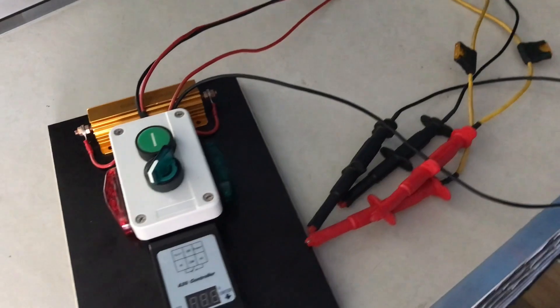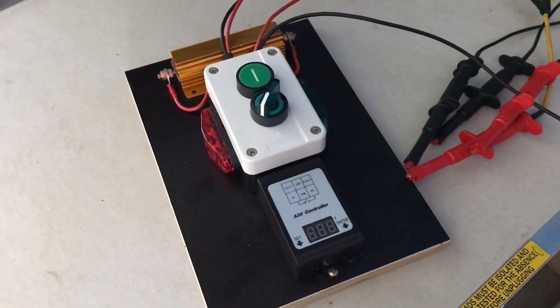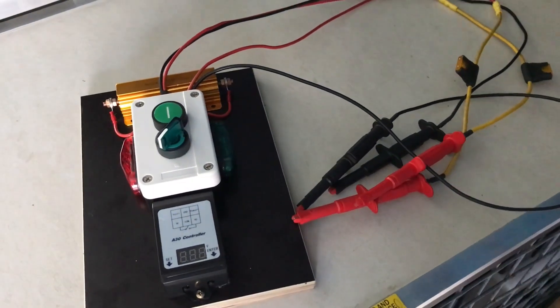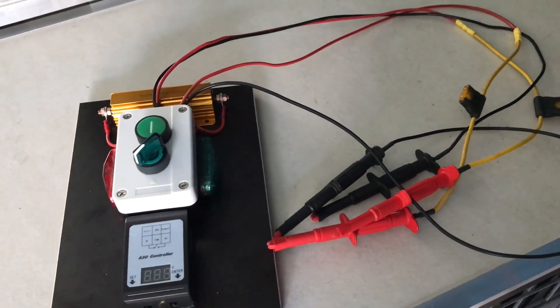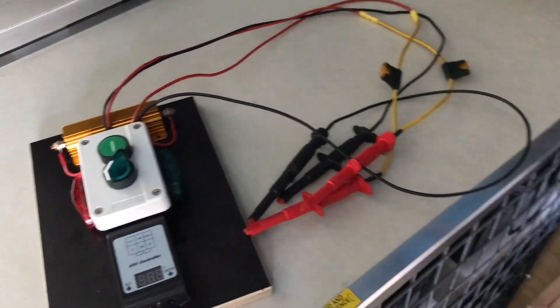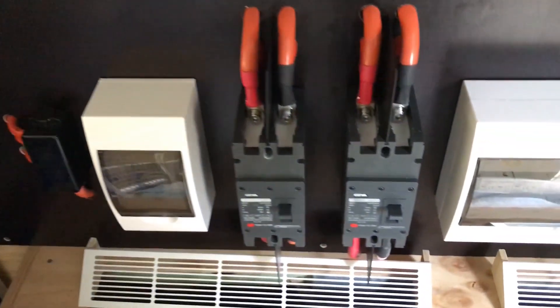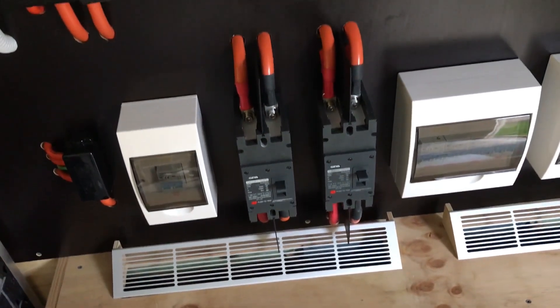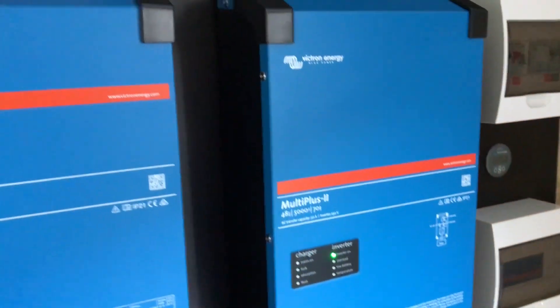It's so much more gentle on the equipment to pre-charge before closing a big breaker like that. The inrush into the capacitors is huge and can end up doing some damage. You're also drawing a huge arc across the terminals of your DC breakers, so it's a win-win having a pre-charger. Alright, thanks for watching everyone — like and subscribe, let us know what you'd like to see in future videos in the comments. We'll catch you in the next one.